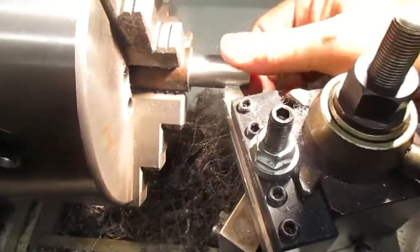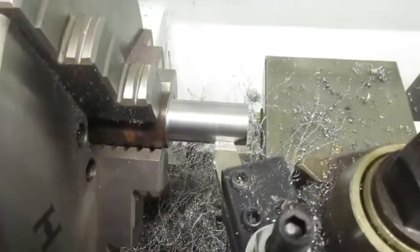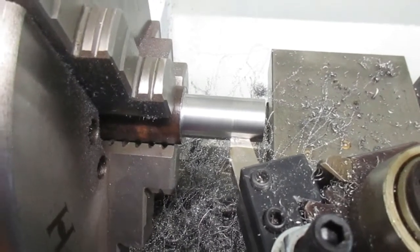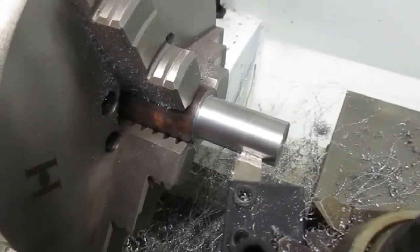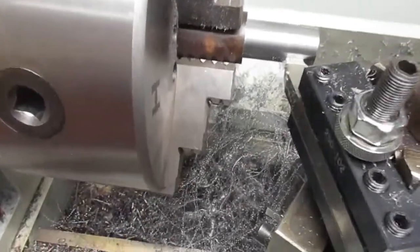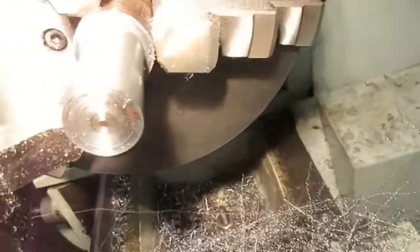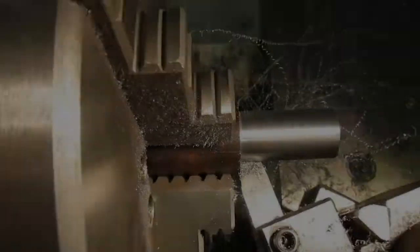Get some of that stuff off there. Not bad for low RPM. Let's try it without — there you go. I'm fairly happy with the grind. Like I say, I need to change some of that trough a little bit to get those chips to break. Anyhow, that's where we're at — so much for all that fancy shear tool stuff they talk about. Mine just ain't bad. Wish I could get a good shot of it — let's try it from above. That'll give you an idea of the surface finish. We'll go ahead and take our spring pass.